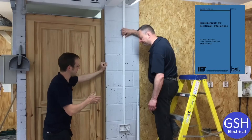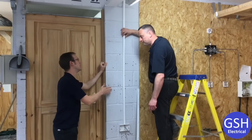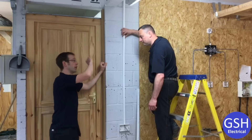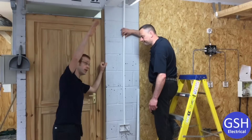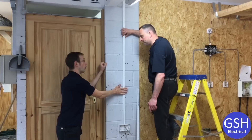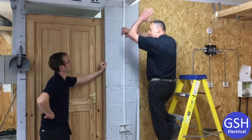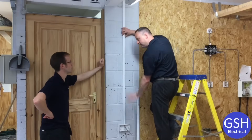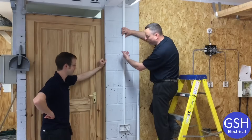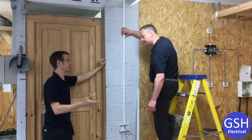One of the things we need to think about is how we're going to protect this cable from the premature collapse of the wiring system. We know we've got to think about cables above ceilings so that if there's a fire the cables don't collapse down. But we've also got to think about all cables now — whether they're in a ceiling or coming down the wall. A metallic clip above the ceiling is fine, but no metallic clips within the trunking itself, so it could fall away from the wall.